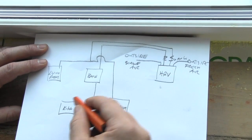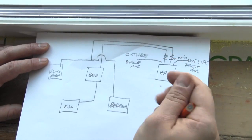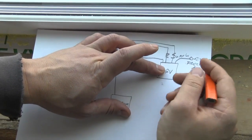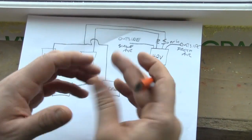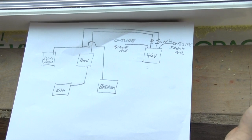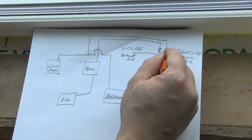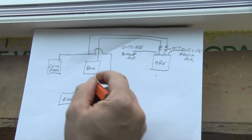These two rooms are constantly sucking air through the unit. What they're doing is taking the moist air that's in your house and taking it to the HRV where they exchange it with fresh air coming in. It mixes and sends all the bad, high-moisture-content air out to the outside, while the supplies take in the fresh air and feed it into the bedrooms and living room.